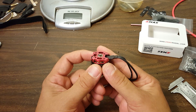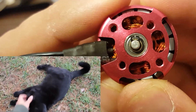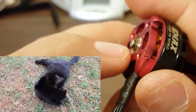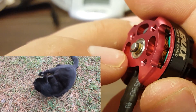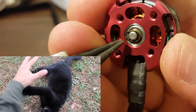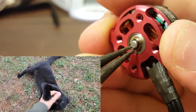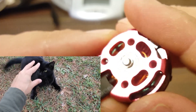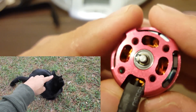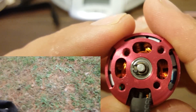Some of you already know how to disassemble a motor. The first thing I want you to see is that there's a little C-clip or E-clip — I can never remember the difference — in a little machined race, holding the shaft on. You'll need to remove that clip, and exactly how you do that depends on the type of clip. In this case, the clip has these little prongs, and they make special pliers just for this. You may be able to get the tip of a rounded needle-nose pliers in there and spread it apart to take the clip off. If you can't, you may have to work at it with a screwdriver. If you're lucky, the motors will have come with replacement clips, but these did not. These clips may not be reusable depending on what happens when you take them off, so you may be about to just destroy this motor since I don't have a replacement clip — but for you, I'll take the chance.